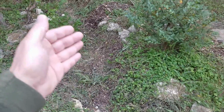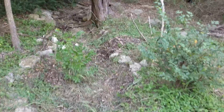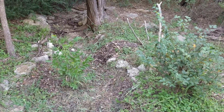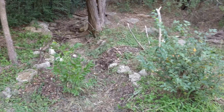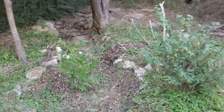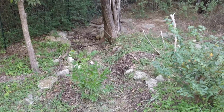I'm going to build a second drain in the berm I described that will drain down the original creek flow, around through the original creek bed. So that should split the volume of water that's flowing into my pond. How much? I'm still going to have probably the majority of the water flow down the original creek bed, but by building that first drain I mentioned, to siphon water off the top, any floating debris, leaves, fine organic matter should go that direction down the front of the garden beds and enrich that soil. And I can dredge that out if I ever need to, if those trenches ever need work. And it's actually quite easy.